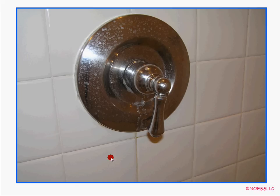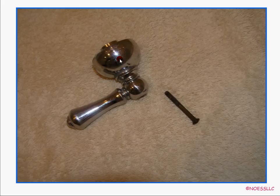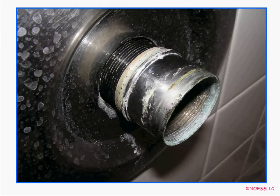The first thing you do to take this particular one apart is pull this little button out. Make sure when you pull the little button out that you don't drop it down the drain, because they're real hard to replace. Then you put a small Phillips screwdriver in here — there's a Phillips head screw that unscrews — and the whole handle assembly comes off, leaving you with this. The handle just fits on there and the screw screws into the center of that nylon shaft. Looking at this, you can see it's threaded right here, so this little sleeve has to unscrew from the plastic piece below — which is what I did, counter-clockwise — and it comes off.